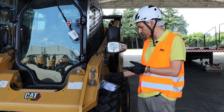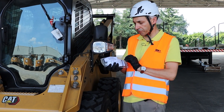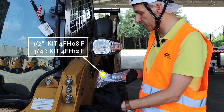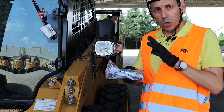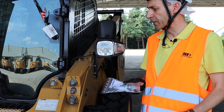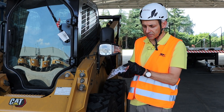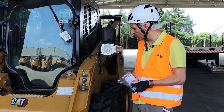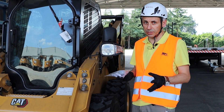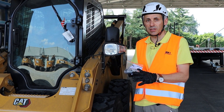But if the leakage is still there, then you have to replace the whole cartridge, and there is a specific service part — you can see one here in a plastic bag with instructions, which is very easy to mount. There is also a version for the three-quarter-inch size. The reason the whole cartridge must be replaced is that contaminants may have affected either the shaped seal behind the front valve or an internal o-ring positioned under the sleeve, and both of these are not serviceable components.